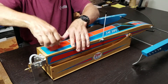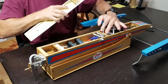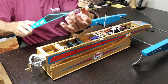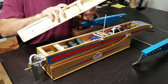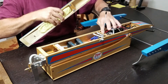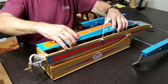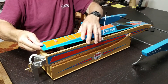Now I can get purchase on the thumb screw to pop the magnets open. Here are the magnets — they attach to these metal discs here. There's a tongue here that centers it left and right, and it hooks under this front lip. These magnets protrude so they drop below this bulkhead, so it can't slide back. Magnets are stronger pulling straight apart — they would come apart more easily sliding — so that keeps it from sliding. That tongue centers it up.